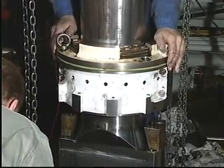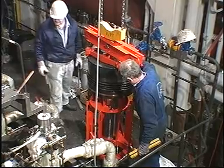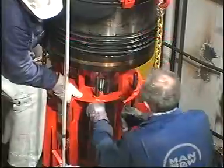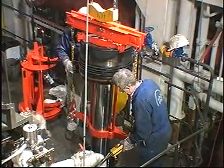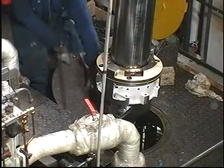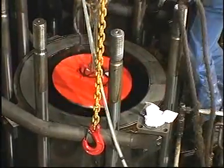Make sure that the guide pins on the distance pieces engage correctly with the stuffing box. Making sure the cylinder liner is clean, mount the piston with piston rod and stuffing box as described in the instruction book. Reinstall the cover on the gallery floor plate. Remove the protective cover in the bottom of the cylinder unit.